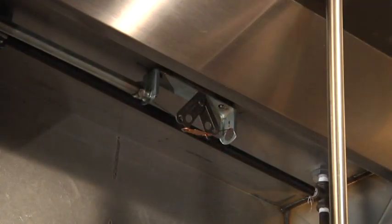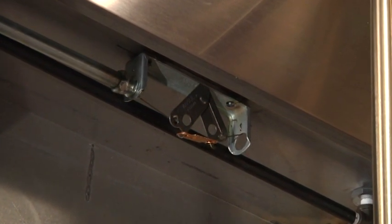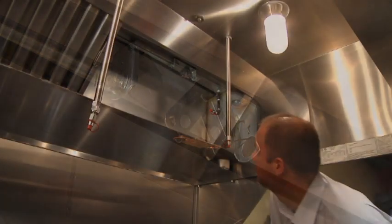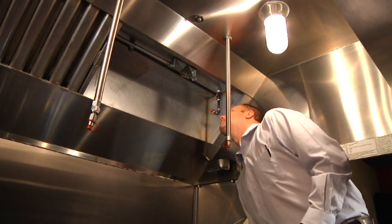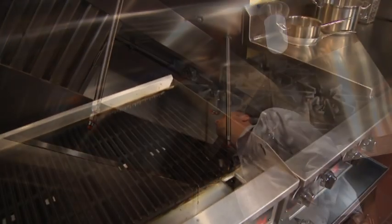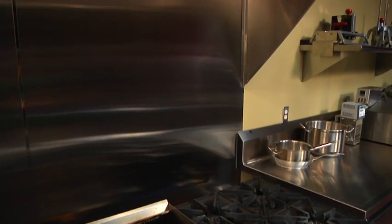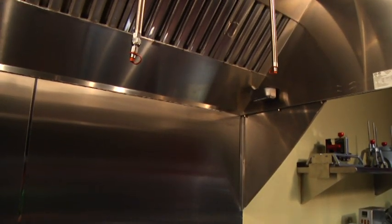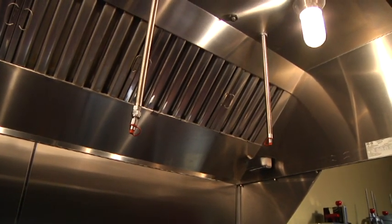Be sure your hood cleaning vendors never use high alkaline cleaners or otherwise corrosive cleaning solutions on the fusible links or cables. While cleaning your filters in the hood, check to see that there is no corrosion on any of the components of the detection systems. Keep pots, pans, utensils, and cooking materials in locations where they will not block the spray from the fire suppression discharge nozzles, inhibiting the effectiveness of the spray pattern.